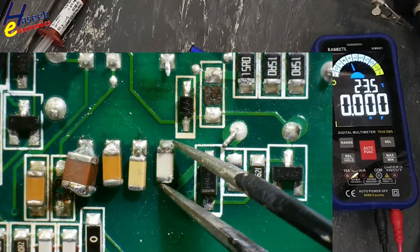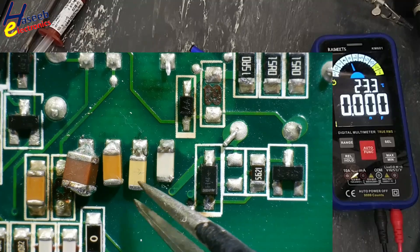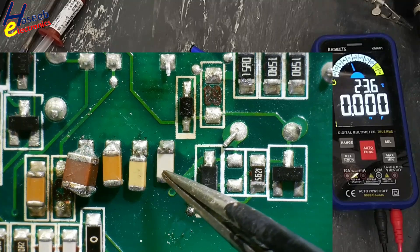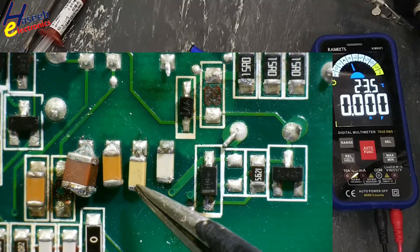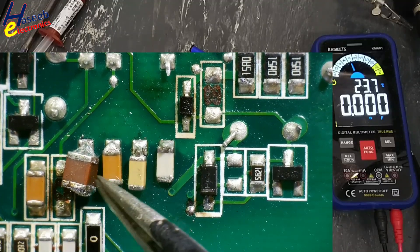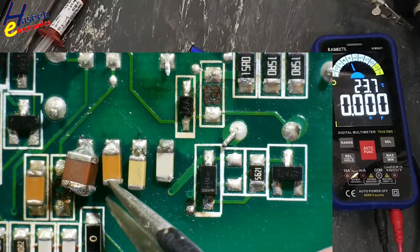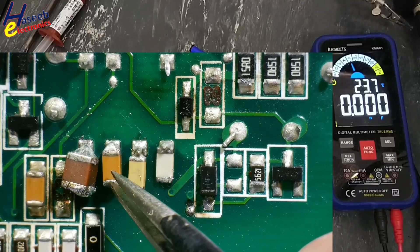So it is used in timing circuits and oscillation circuits. Yellow and light brown are in the nanofarad range. It is slightly less stable compared to the NP0 capacitor while changing temperature and voltage. Brown, dark brown, and black are high capacitance in microfarad, less stable with change in voltage. Capacitance will decrease nonlinearly.